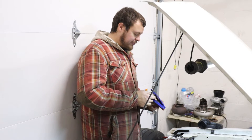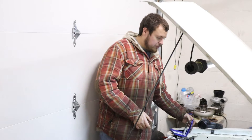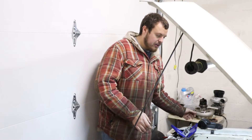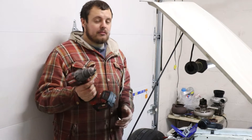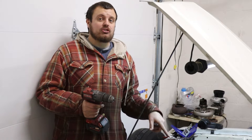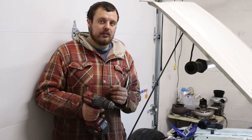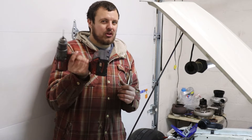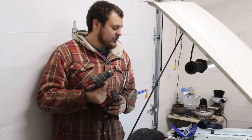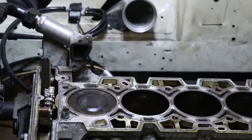I normally start with the number 2 size and you will chuck the left-hand drill bit up in your drill. It's important that you drill through the center of the bolt because you don't want to damage the thread. Also, the center of the bolt is the softest part, and you don't want to dull your drill bit for no reason. I've already gotten two of the bolts out already, but I'm going to show you on the next one.